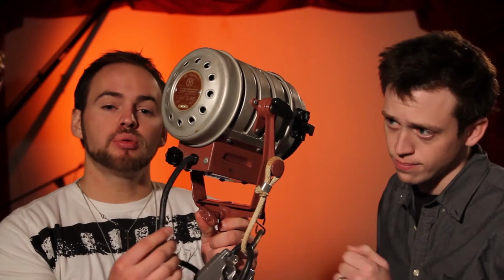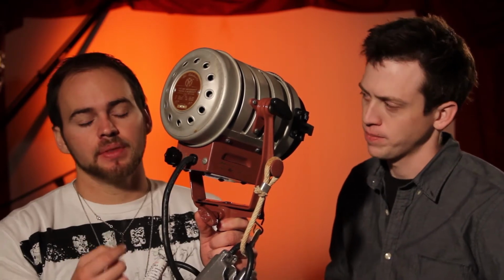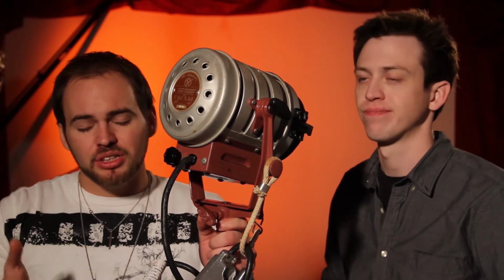Now, these lights are very heavy duty, and they can take a beating, believe me. However, you don't want to put unnecessary tension on the back of the wire back here, because the more you pull on this, and the more you put tension on the wiring going into the light fixture, the more you're going to have to replace your wiring system. And we just don't want that to happen.